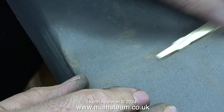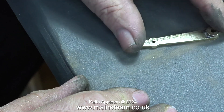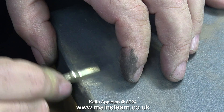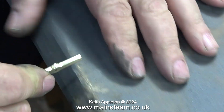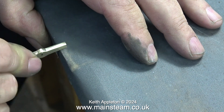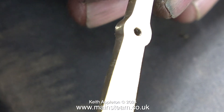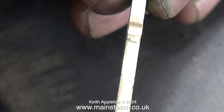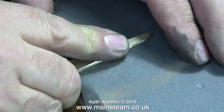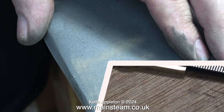All I need to do now is finish this part on a piece of wet-and-dry sandpaper. The sandpaper is overhanging the bench with one edge folded down — that makes it much easier to sand the part up to the edge, like the bush that's silver-soldered onto the end. This job is very tedious and takes a long time, but you need the reversing lever to look like a casting. Folding the sandpaper over the edge helps me get the curved part the correct shape. This took about 25 minutes to complete.